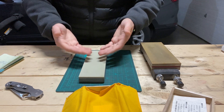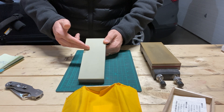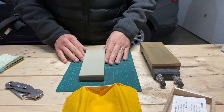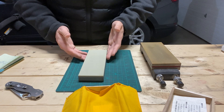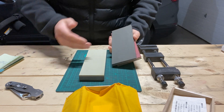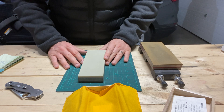Why not diamond plates? For one, I was hoping for a better finish over diamond plates — that remains to be seen honestly. But in terms of cutting speed versus finish, I think this wins against the DMT coarse. And the thing is, this is not going to wear out ever. Whereas I've got one of those DMT plates that's totally worn out, and one of those 2x6 ones that's pretty well worn out — and that was probably after six to eight months of use. The diamond plates just don't last if you actually use them, and I like to use them on K390s, 10V, Maxamet, Rex 45s of the world. My favorite stone from the Venivs is the 240F — the coarsest one — so this just seemed like a natural spot. I needed something that could reset bevels, thin out knives, and just do all those sorts of things.